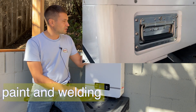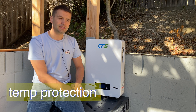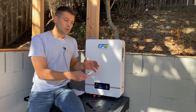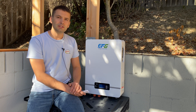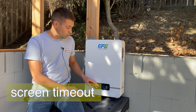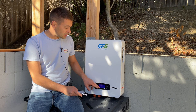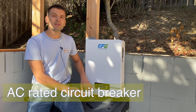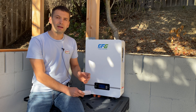Items that could be improved: first is paint quality — I saw many imperfections on the outside of the box. Second is high temperature disconnect: I tested that it disconnects at 65°C, but because the temperature sensor is located on top of the cells between them, actual cell temperature could be much higher. It would be great to have the ability to adjust high and low temperature disconnect thresholds in software. Third is the screen — the default timeout is about 15 to 20 seconds and can't be changed, and when the screen shuts off it resets to the home screen instead of resuming where you were. Fourth is the AC-rated circuit breaker — it would be better to have a proper DC-rated circuit breaker, because even though we tested at 300 amps and it worked, in the long term we might see arcing and it could blow.